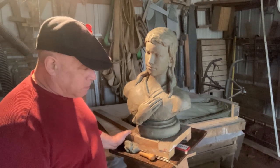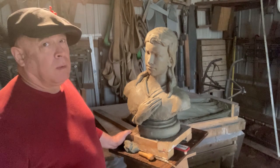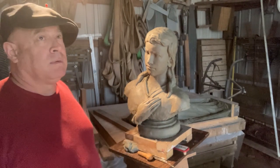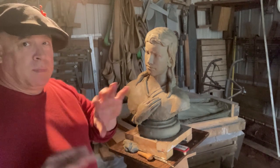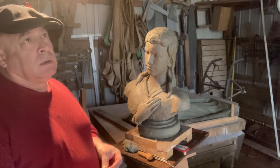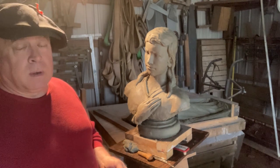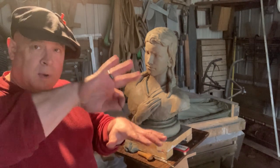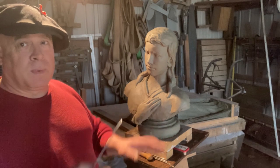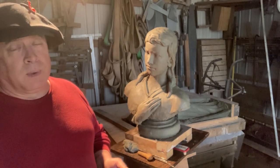This larger piece of stone weighs four tons. I've got a 10-ton hoist on my crane and a 3-ton hoist on my crane, so I can use one to pick up and the other to manipulate, so I don't have to physically try to pick something up or push something over, or get under a stone — because that's dangerous. You don't want to do that.